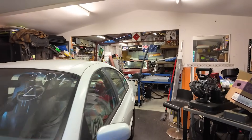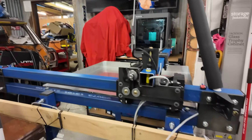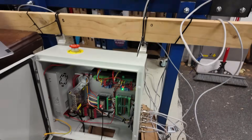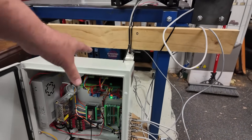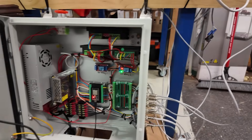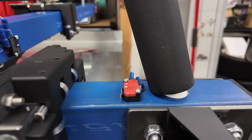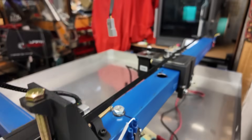So let's have a look. I've got the car poked out a little bit, so I've given myself some room up the back. I couldn't take it out altogether because the weather's been very ordinary. There's the table. I just haven't had time to mount the box properly - I've got it hanging via cable ties off a piece of wood that I've cable tied to the frame. We want to have zero connectivity between the box and the frame, so I'm going to have to make up some sort of mount arrangement. You can see the box there with all the electronics. We've got all the wiring off the side - I will have to tidy all this stuff up. And then I've got our limit switches in there, and on the side as well. We've wired up all our motors and stuff.